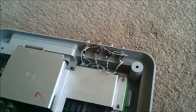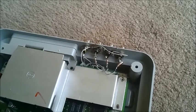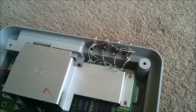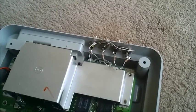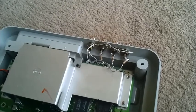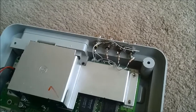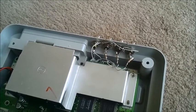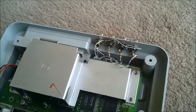The 75-ohm was the best I could get. I experimented with a few different other resistors to see what would work out. Without the resistors at all, it's bright but really washed out — the contrast is way too high. I've done some searching online and really haven't found anything with exact certainty that it'll work any other way, but this gets the job done for now.